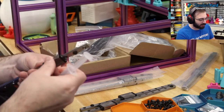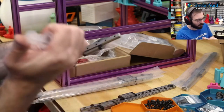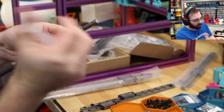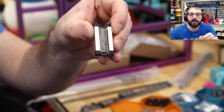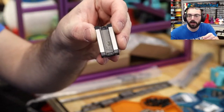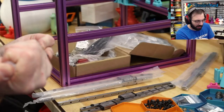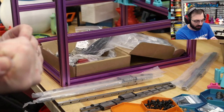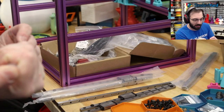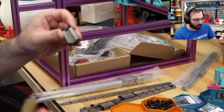But as you can see, when you do that, like, I'll squeeze a little bit on for show. It goes on the base, so it doesn't actually go where the balls are. So you want to get the grease really precisely under the bearings, so that it gets pressed up into the bearings when you slide it in. That's the only part that needs to be greased.